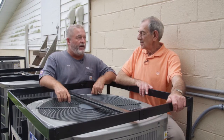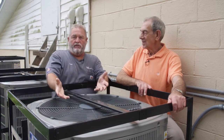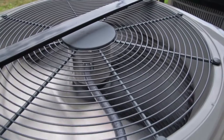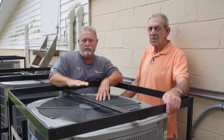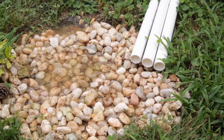A conventional unit, once it meets temperature, goes boom — shuts off, stays off for about 15 minutes, then kicks back on at high speed. If it's a four-ton unit pulling 25 amps, that's what makes your power bill spike. With this variable unit already running, you don't need that surge of power to restart — it just changes speeds, lowering speed and using less electricity while actually pulling out more moisture.